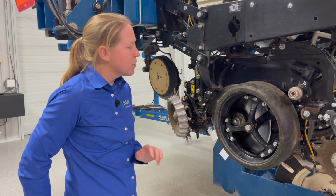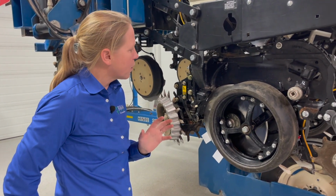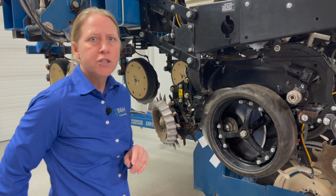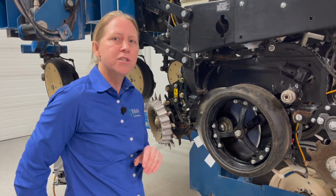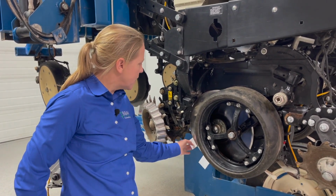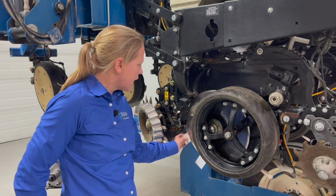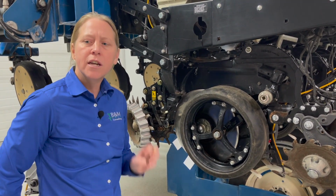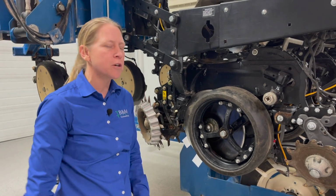A lot of the OEM blades, we've really struggled there. One of the ones that we've gained a lot more uniformity on is what we have on this planter. It's called the GBGI blade. So it's a little bit more consistent on the blade, with a few less issues there. On the Case planter, it's a little bit different. You don't actually want your card to catch. It should just keep very carefully sliding through there, not quite catch. So some of that does depend on your planter.